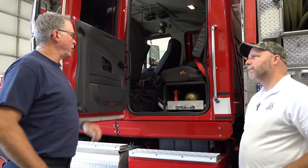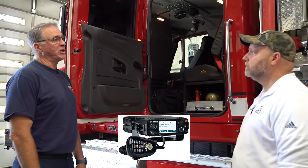One of the challenges we've had, even going district to district, is communications. When you're going all over the nation, how do you communicate? Do you have a radio system that branches everybody? Yes — here in South Metro we use the 800 system. When we travel outside, we use a Bendix King VHF radio, and those are clonable radios once we get to the incident. We go to the radio tent, hook up our cables, and clone to the local channels. So every fire will set up their own radio channels per that fire and we get that cloned — now we can talk to anybody on that fire.